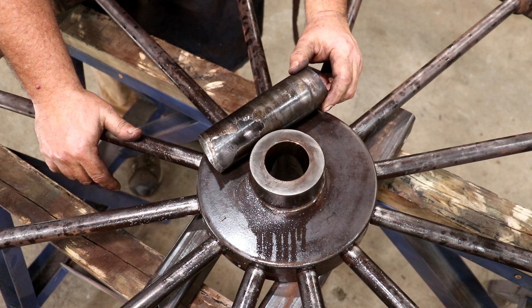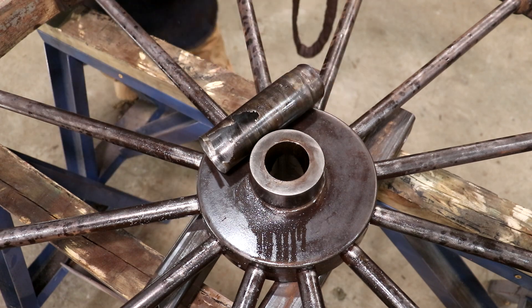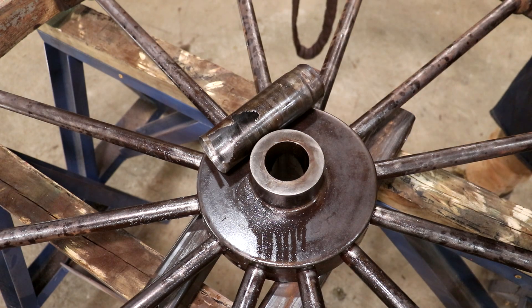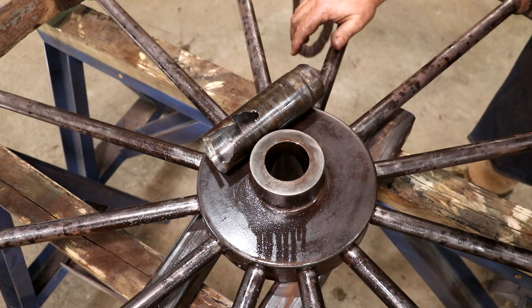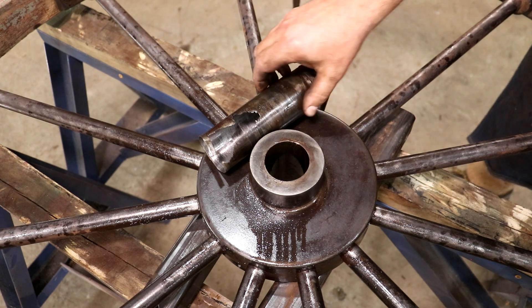The bottom of this shaft is 100 thousandths larger than the top — so it's a tapered shaft, and that's what was holding it on. Probably what caused me the most grief was when we were trying to loosen that nut — it was a left-hand nut on the other side — and I was actually tightening that taper up even tighter than it was originally. It probably just got so tight it didn't want to come loose. A taper fit can really be a tight fit. But when we drilled it out and got most of the metal out of there, it lost a lot of its strength and was fairly easy to drive out. Making this tapered shaft is going to be a challenge on the lathe, but nothing we can't do — should be able to do it with the taper attachment.